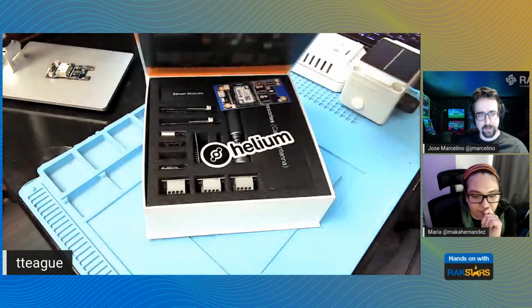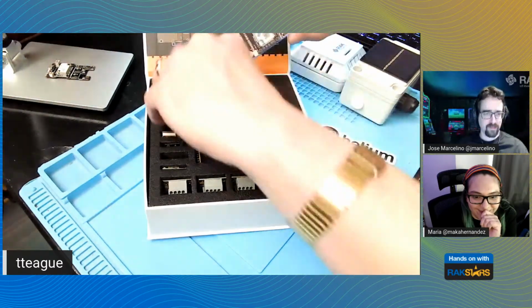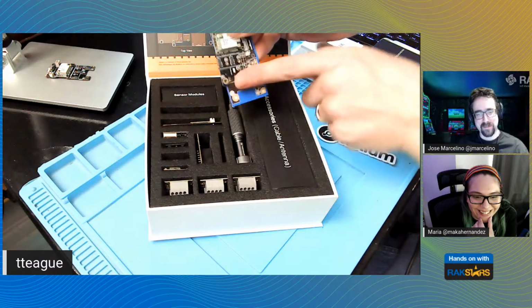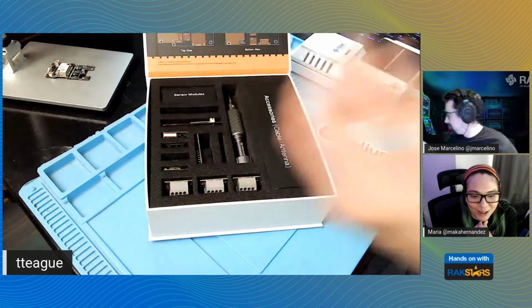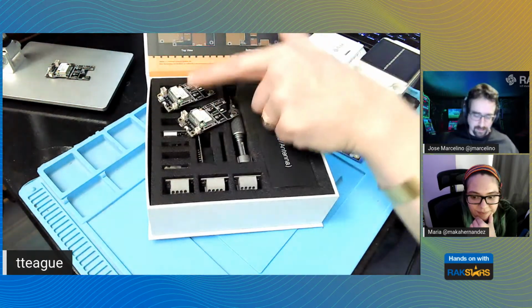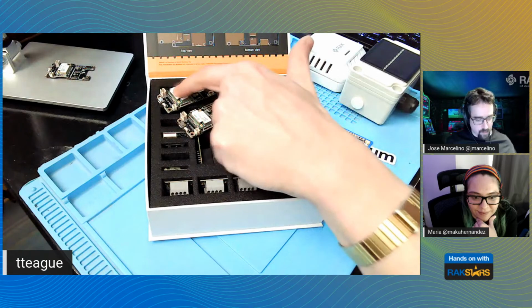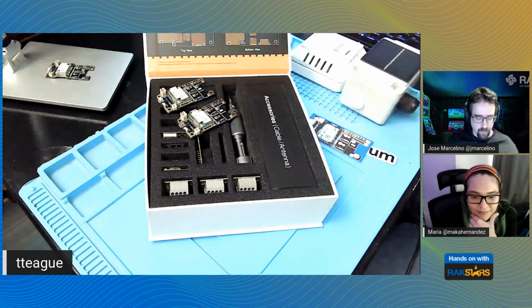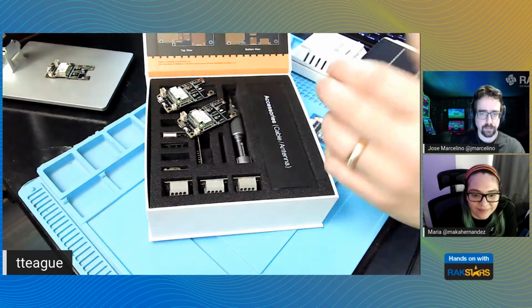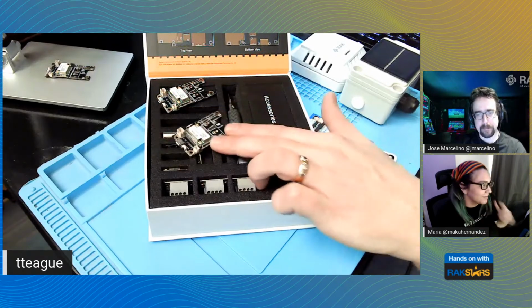What always gets me is that this card comes in the kits and is so much larger than the actual board itself. That just tickles me, but it's so much larger so you can actually see the board. Anyway, you have two of these boards, and 2 of the cores that are already connected. These cores are replaceable by other cores that RAK will be rolling out more of in the future. But the ones pre-affixed onto the baseboards have a Nordic chip which has BLE and a LoRa stack on them, which is so cool.